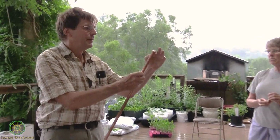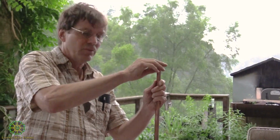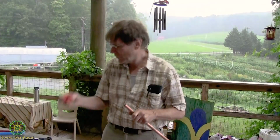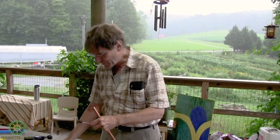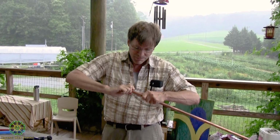So basically, I've cleaned that up. Get the rough stuff off, so as long as I can't cut my finger, I'm fine. But that has to be square and nice and clean. And it has to be so clean that we take these, this is a 1/2 inch set, and there's a 3/4 inch set in that box for the bigger tube. We have to make sure that the outside of this pipe is really clean. This has little brushes in it, stainless steel wire brushes. We're going to get on there, push it all the way to the inside, and turn it in one direction.